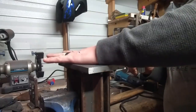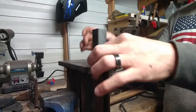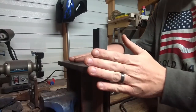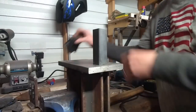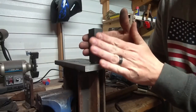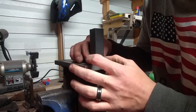We've got the frame mounted upside down here on the vise. Of course, you've got to put a hardy post on this thing if you want it stationary on your anvil. Got some one inch solid. I'm going to offset mine because I want the center of this more towards the center mass of my anvil. So I'm going to put mine on this side here. Just got a nice heavy chamfer on that, so I can fill that weld in. My hardy hole is an inch but it's a little worn on top, so I have a little room for my weld — I want most of my weld up inside there so I can grind that clean and it'll sit down there nice and flat.